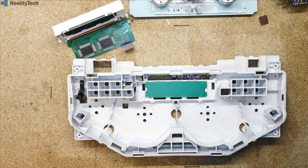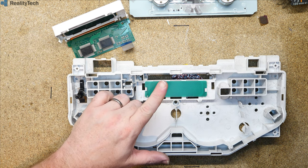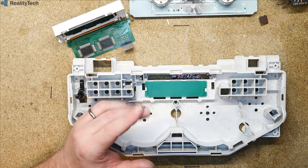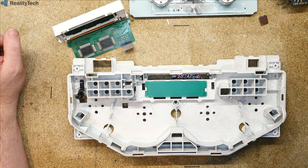Gut feelings on failure points. I don't think the zebra strips are going to be a problem. The tag tant might be a problem long term. They can be unstable and they can fail. I suspect it will survive a reverse power event, but other than that, it's basic, but it's solidly built and should survive. I just think it was probably a little bit early for it.